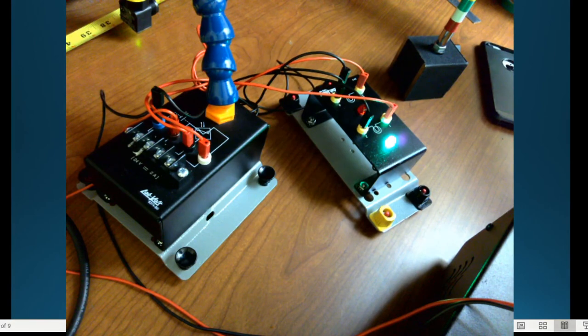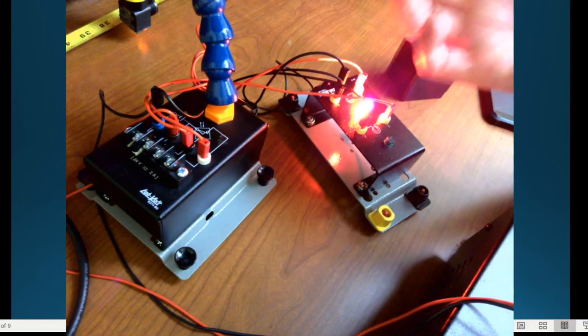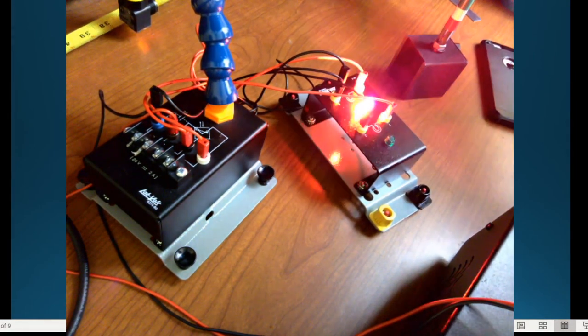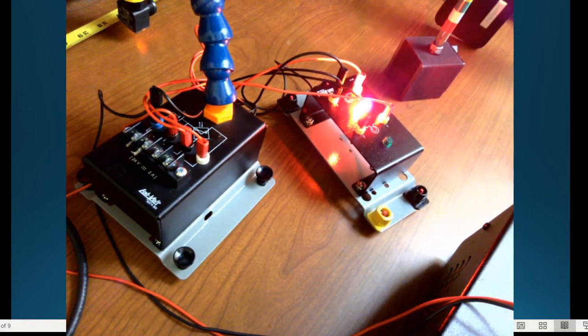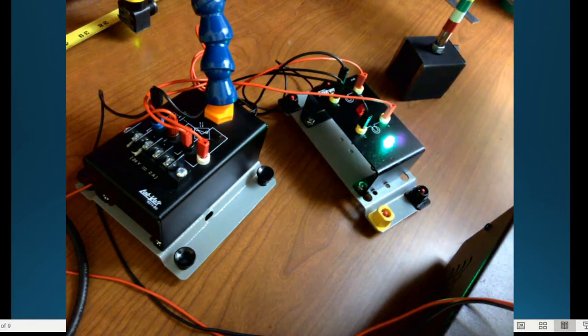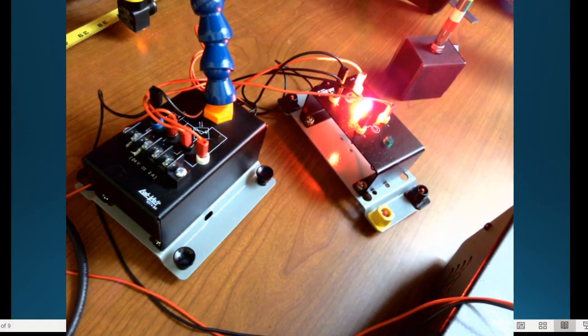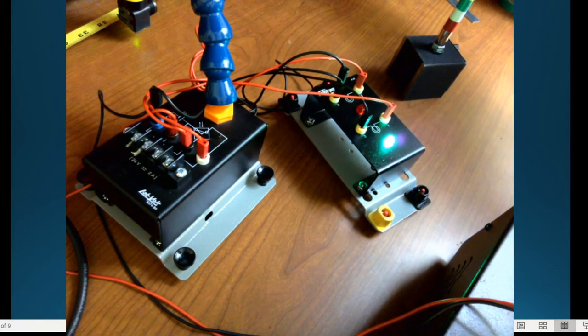Okay, so what happened here is the green, or the normally... what we're looking at is the signal coming off the normally closed output, where previously we were looking off the normally open. So when something moved in, that's when we triggered out. The other thing is, it might be that maybe you have something in the target. I'm not really thinking of what that might be. Maybe it's a fire extinguisher. It's kind of a silly example. But as soon as somebody picked up the fire extinguisher, it goes off. So however you want to trigger that. It's probably not the situation where something is moving out, but something is moving into the target.